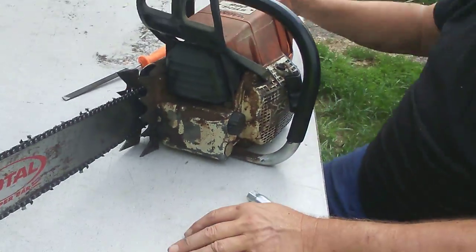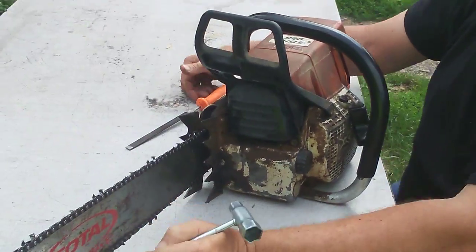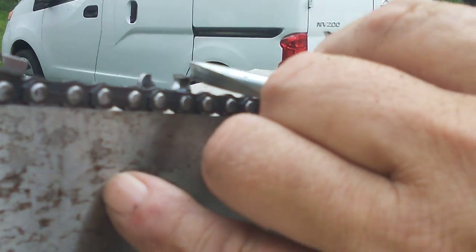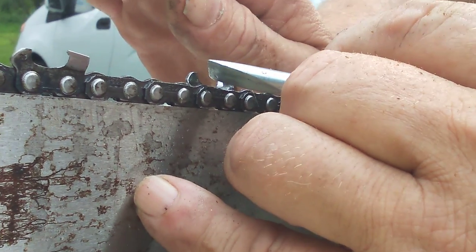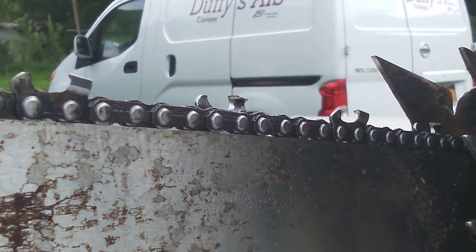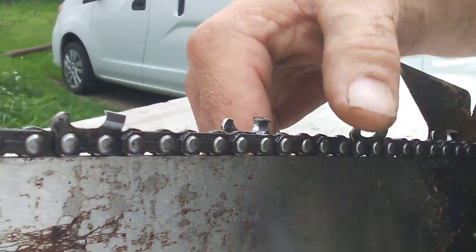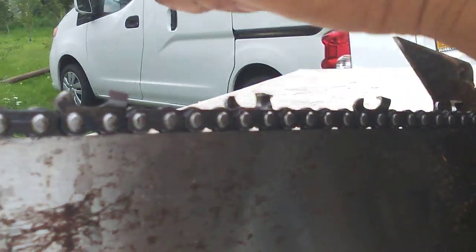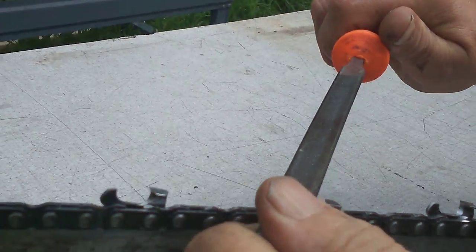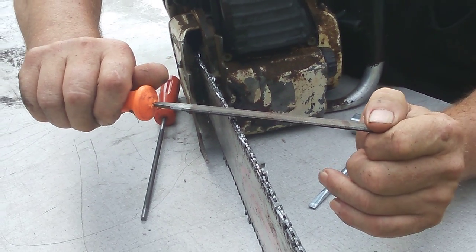On the east coast we don't point our depth gauges, and the reason is our chains work better when they're right down to this point. The distance from here to here is longer — that means your depth gauge is more efficient. When it's worn out to where you heard 'close,' that tooth will rock like this a lot easier; keeping this geometry keeps it stable. When we file straight across like that — no noise — you follow your tooth angle. You'll never have vibration when it's right.